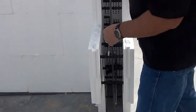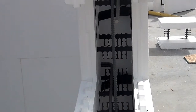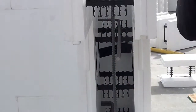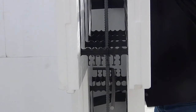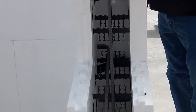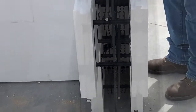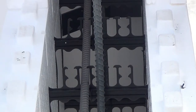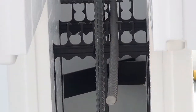And that's how our rebar is going to be placed in there. I'll do one more in the back where the rebar is a little bit tighter, like our corner. You just want to check it and make sure that it's staggered there between the block. That's what the inspectors are looking for — rebar that won't touch the side of the wall. So we are staggered in between our horizontals, our verts down here.